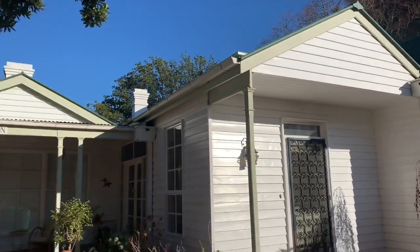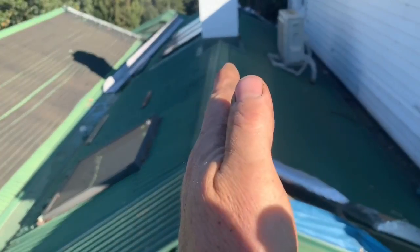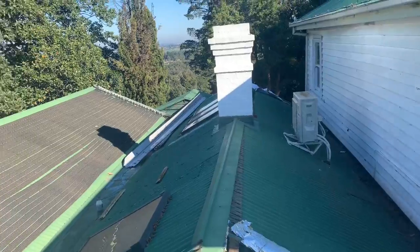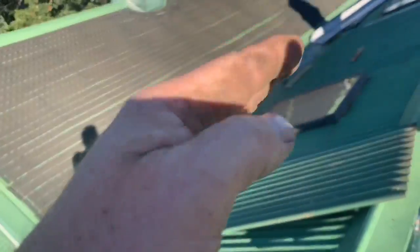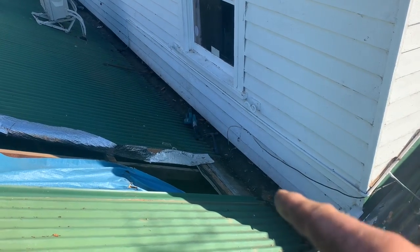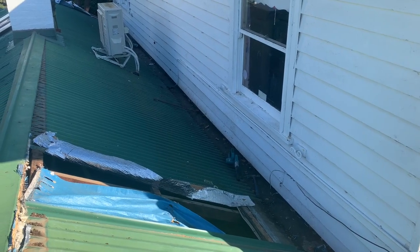It's going to be quite a tricky job. So a bit of an overview of what we're going to do — this roof here, either side of the ridge is getting replaced, all the way back to the end. The roof underneath all that black tubing is getting replaced — that's the solar for the pool. The box gutter through the middle is all getting replaced. Today I've got to replace the box gutter — it starts from here, that's the high point, supposed to drain down that end but doesn't drain very well. So I've got to strip all the roof temporarily, rip the box gutter up, take that bottom weatherboard off. I've noticed there's heaps of electrical wires clipped to the timber — I'm gonna have to drop them. We've called an electrician to come out and do it.